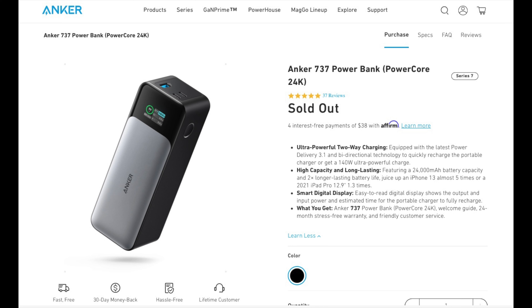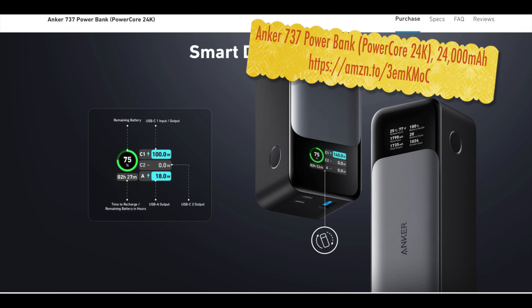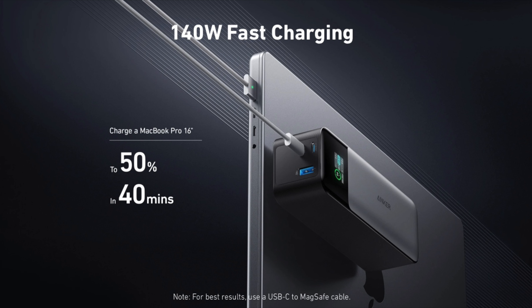I wanted to do a few quick tests to find out if it actually delivers that amount of power in a short period of time. I have a fast charger that gives me 90 watts and another that gives 120 watts, but I didn't have any device that can draw that much power. My power banks take up to 60 watts, and it more than delivered those 60 watts. My concern was the actual capacity — they claim 86.4 watt-hours, but from all the tests I've done, I was only able to draw about 75 watt-hours.